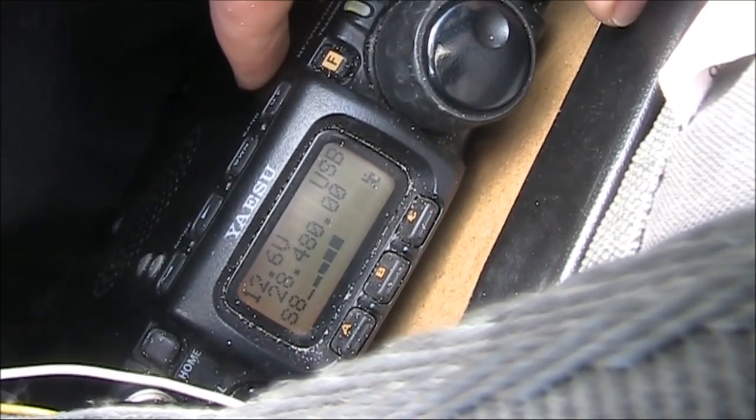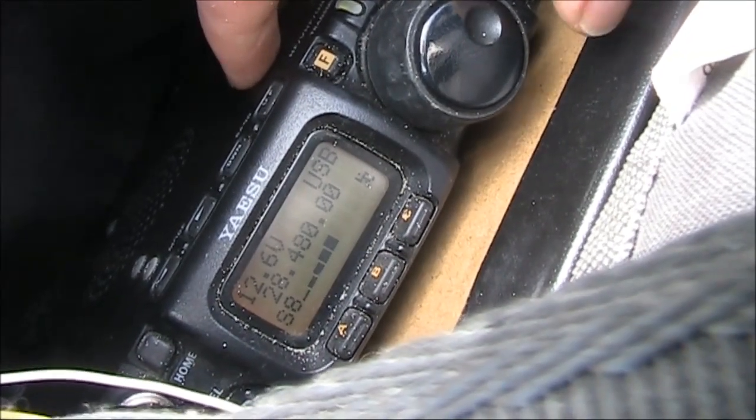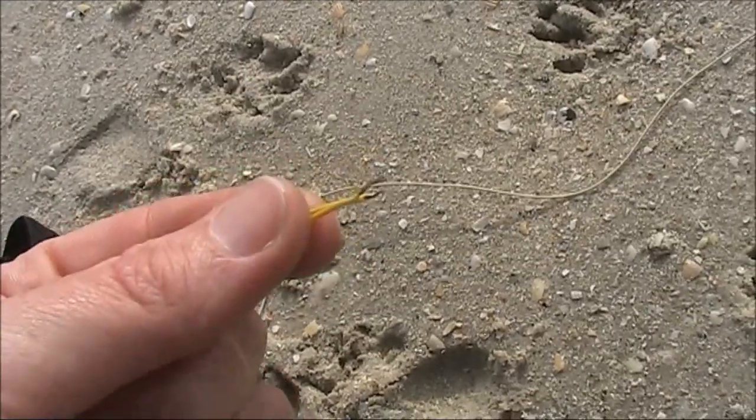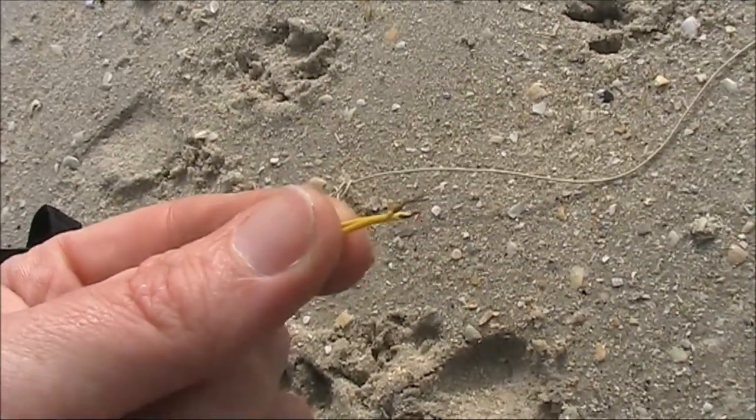10 is firing on all cylinders, so time to half the antenna and make it a quarter wave on 28 MHz. I won't cut the wire — I'll fold it in the middle and twist the two ends together and connect that to the transceiver.